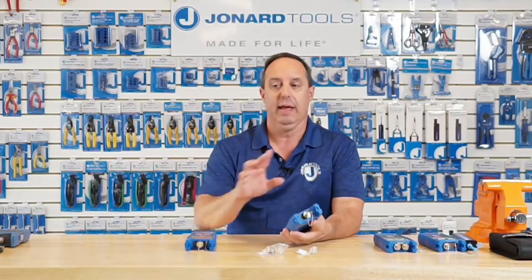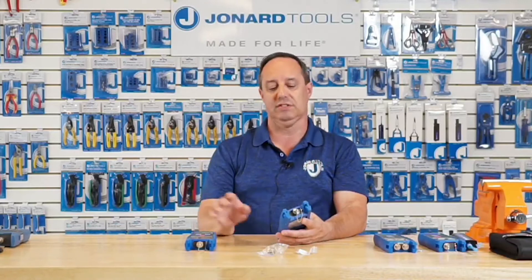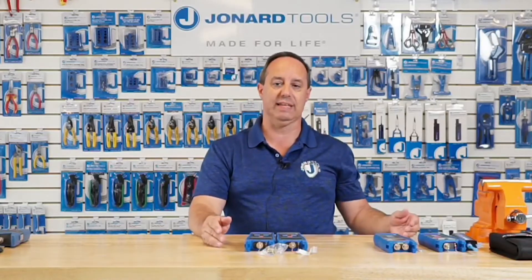That's the FPM-50A. Its power range is from minus 50 dBm to plus 26 dBm. The FPM-70 is essentially the same as the FPM-50A, only its power range is from minus 70 dBm to plus 6 dBm. This is really designed for long haul, very long run cable.